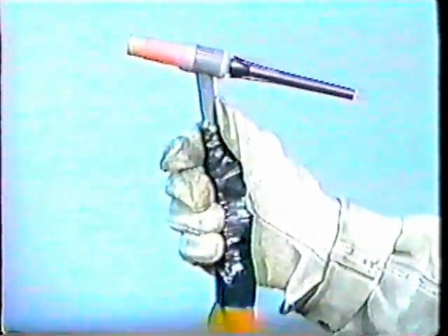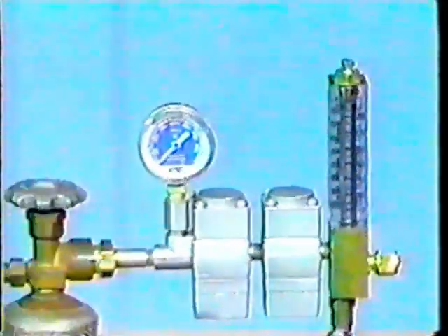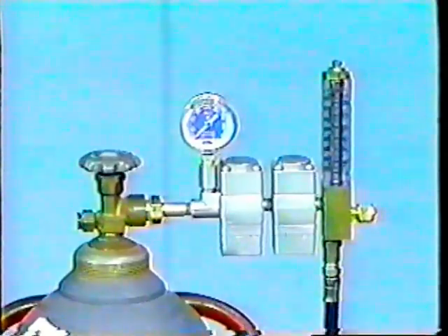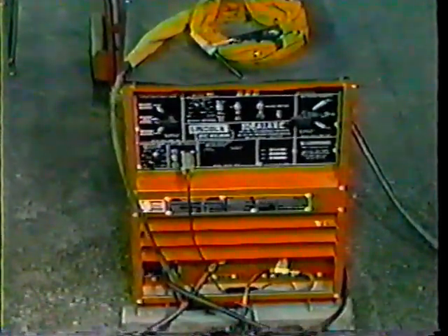Let's review the welding equipment: a welding torch with combination power cable, water, and gas hoses; a flow meter with argon gas supply; a 300 amp AC-DC welding machine; tungsten electrode; stainless steel filler rods; and stainless steel coupons six by one and a half by one eighth inch.